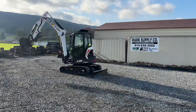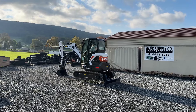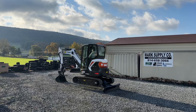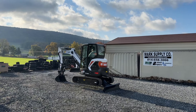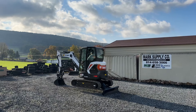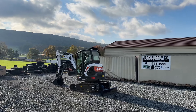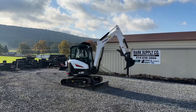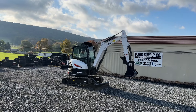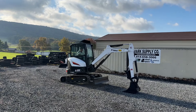I do like the E35 size machines. I've owned a pile of these machines — they are a very good excavator. This is what's called an R series, so it does have the newer style undercarriage where the rollers are two-speed. It has the outside style flange bottom roller where the old series machine had a center mount flange. You can see how we're turning the tracks under load — that indicates you have strong travel motors and hydrostat on the hydraulic pump.